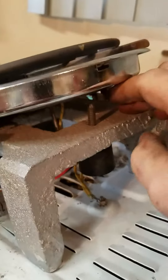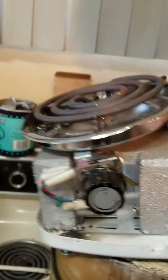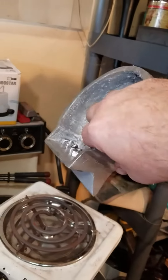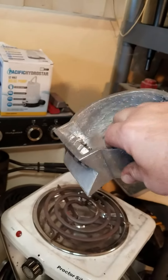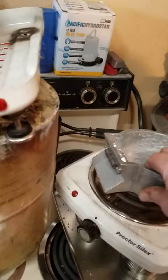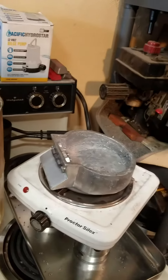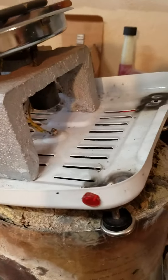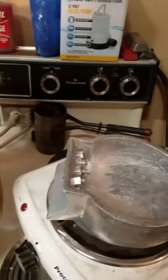One of the things I'm going to show you that's kind of critical is the ability to change the angle of your heating element, because the head pressure that develops when you start tilting this dictates how fast that lead is going to want to pour out of your shot maker. When your lead is hot and thin, you're going to want to back off the angle. When you're at the end of your casting session and you want to get the last of the lead out, you'll want more angle.